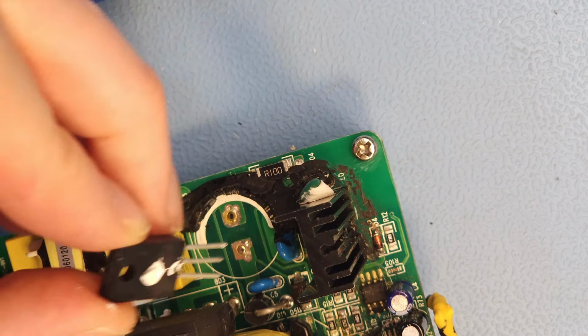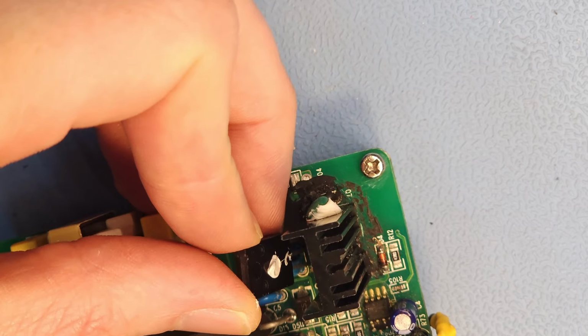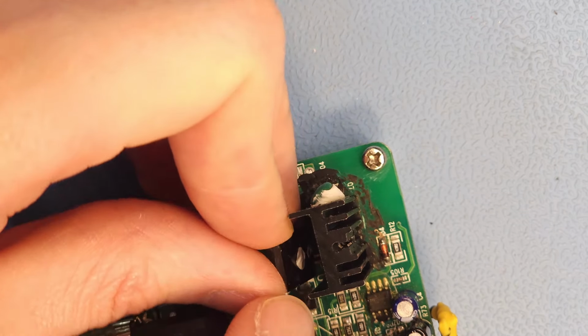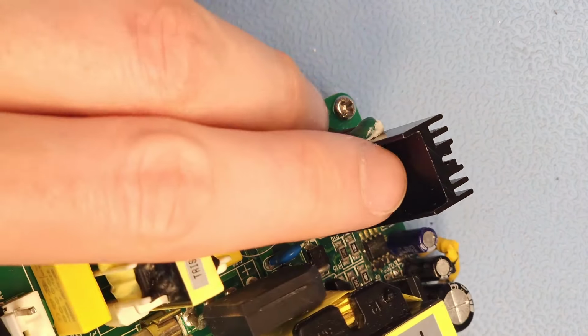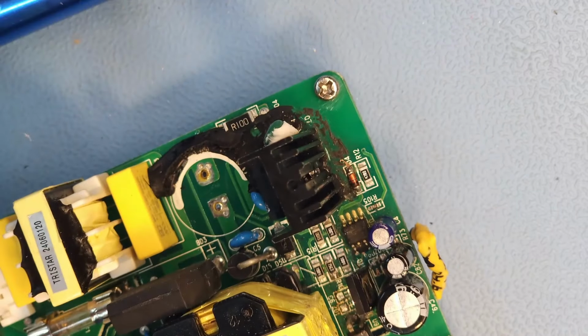And then I get it all across my fingers, all over my fingers probably, while trying to fiddle this in the PCB. Yeah, it is in. Okay. Bit lower. And I'm immediately going to screw it in place, because if you do it the other way around, if you solder it in place first, you might have the issue that the hole doesn't line up, and then...